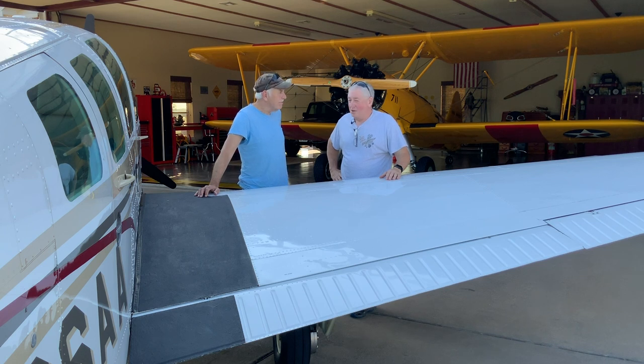We'll know soon. One of the things we learned is that he has the altitude preselect enabled in his G500, and to use it, you have to go into the altitude, set the altitude, and then hold it to arm the altitude. But you want to do that last, before everything else is all set up. You've engaged the autopilot in heading mode, you got your climb set up, and then you set the altitude, and then you arm the altitude preselect last. Otherwise, it's going to reset, and you're going to bust your planned altitude.